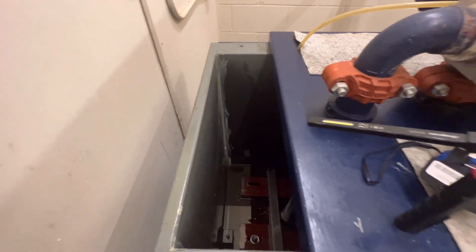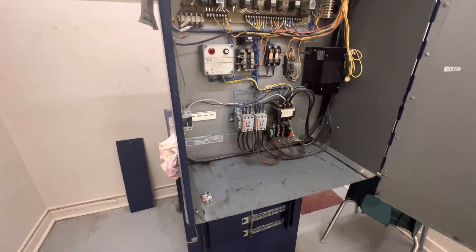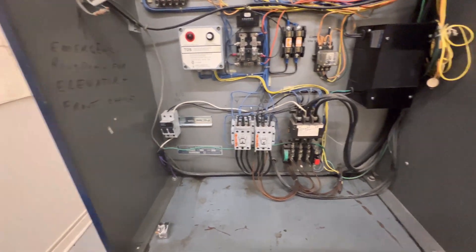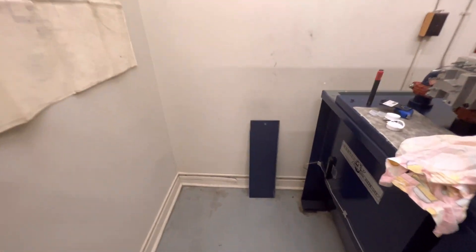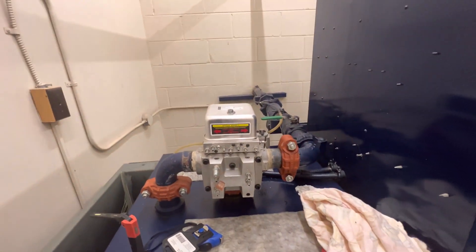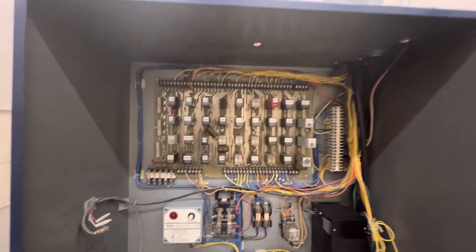When I came today, I did the leak down test for an hour — it didn't move. I threw a couple of jugs in and bumped it up. You can clearly see it's leaking from the scavenger line right into a drain in the pit, which isn't ideal, but I'll fix that tomorrow. The cylinder itself is fine — the packing is bad but it's okay to run.